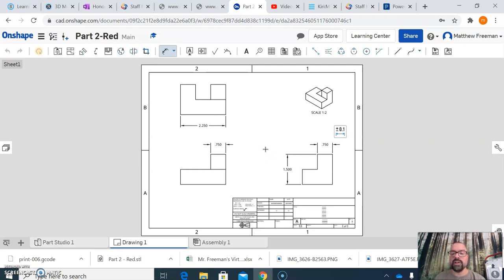This 0.75 here is not the same 0.75 as this one — even though they look similar. This one is looking from the front showing width, which is more clearly shown in this view. Where a dimension could go in either of two views, choose the view that makes it the most readable and the least cluttered. I'll let you refer back to the provided drawing sheet for the remaining dimensions.